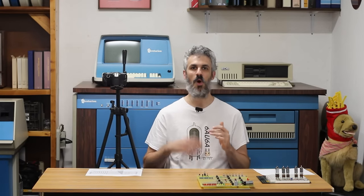I'm going to fire up the mill and cut those PCBs out — they're pretty long boards, but this one cut really well. I think I've finally got my method for cutting PCBs dialed in because this one came out really beautifully. Of course a blank PCB doesn't do us any good, so I've got to solder all the components onto it. There are a lot of components — 16 vacuum tubes with seven pins each, each pin with its own individual one-millimeter PCB header — so that's a lot of headers to solder. Once we've got everything soldered in and the tubes all plugged in, it came out looking absolutely stunning.